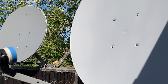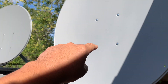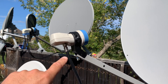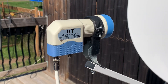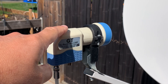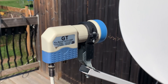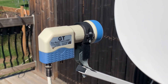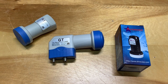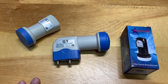The next part of the dish is the LNB — this is kind of like the antenna of the dish and plays a really important role. The signal bounces off the satellite dish pan from space, gets focused, and then gets fed into the LNB, which sends the signal to your satellite receiver. It's really important that you get a linear Ku-band LNB — one capable of receiving satellite signals that are linear in nature, meaning they travel in either a vertical or horizontal line.